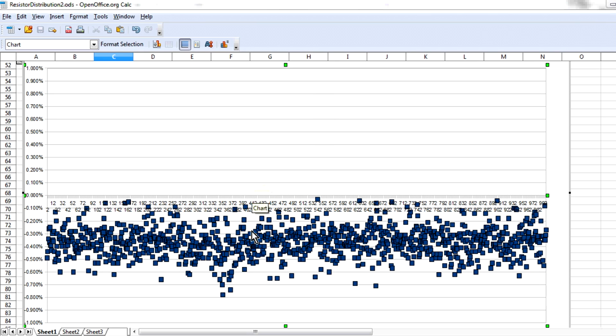But look at this. It is offset. It's clearly offset about negative, say, 0.35 or thereabouts on average through the middle of that. There's not a single resistor that is above 1K. There you go. That's what we found from these OneHungLow brand resistors. Whereas the Philips ones in the previous blog you saw were pretty much spot on the nominal 1K, and then they deviated either side. But these OneHungLow brand ones show a negative offset. Go figure. And of course, there's actually no problem with that because they're still within the nominal plus minus 1% tolerance.